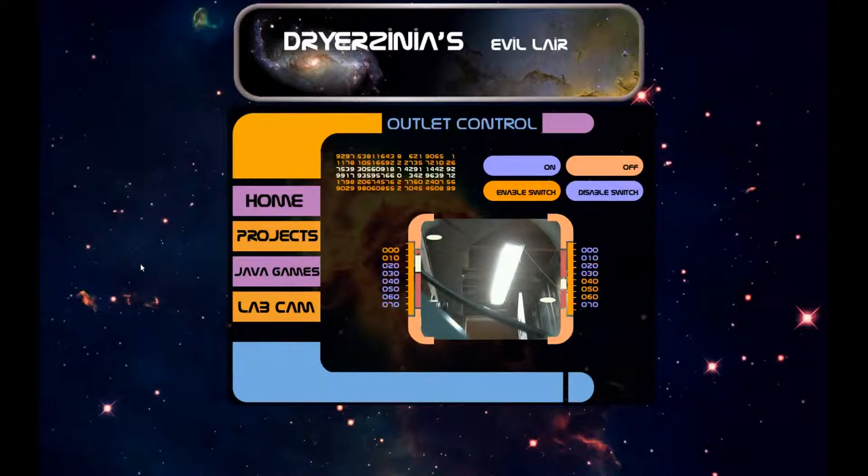This is the web interface for the outlet controller. This is an MJPEG stream coming from the camera — you can Google that software; it's the best thing for low-delay video. There are some cool animations and it's got a Star Trek theme. How this works is these use jQuery AJAX calls to request a PHP script on my home server, which then executes a Python script that has to be in the dial-out group with www-data so it has access to the serial ports to send commands over the MRF24.